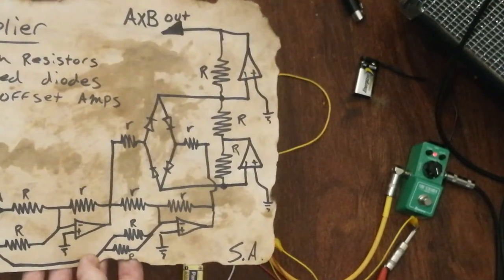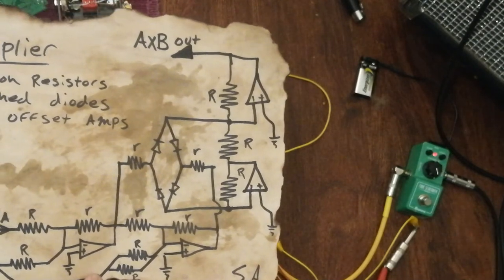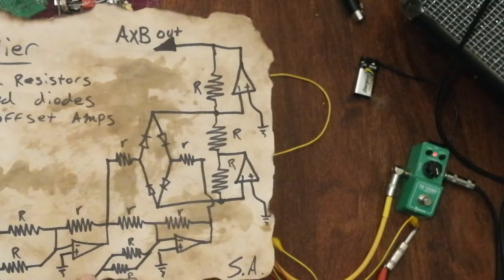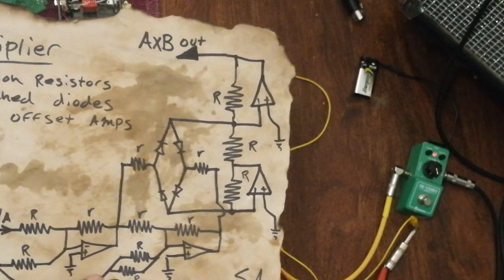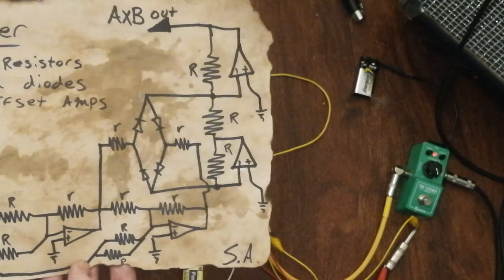So now if you total up the op amps involved in 16 4-quadrant multipliers, you just have 18 op amps. And that's a lot less apocalyptic. So I was pretty happy that I was able to pull that off, just 18 op amps for 16 4-quadrant multipliers. So of course there's still 16 rings, but it's a lot less.